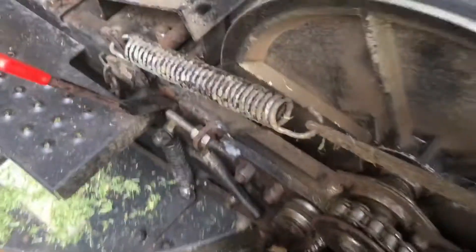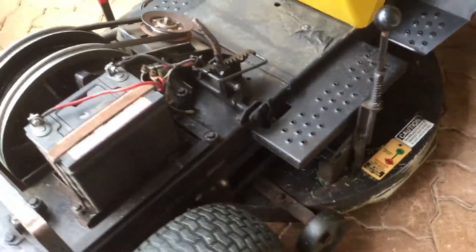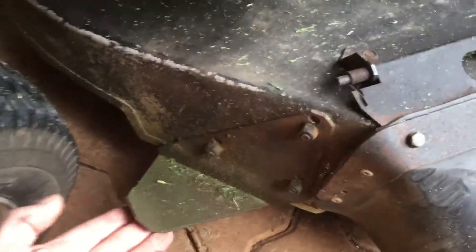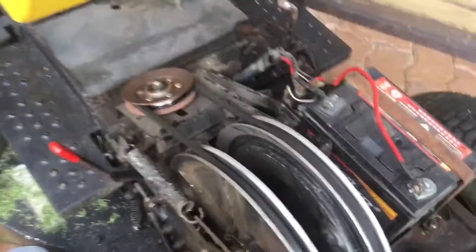Another little thing here — your deck. Now, a little short-ass deck leader, right. You go, geez, that's a short deck leader — that's a cast aluminium deck, and you can also get a fabricated steel deck. There are people that make these too. But if you look at these, they're quite well designed — they're opened up at the nose, opened up around the front. Skid plates on there — this is the base model. There's adjustment on these skid plates, so you can adjust that, drop it down a bit lower if you want the skid plate hitting before that. I'm pretty cautious with mine. Anti-scalp wheel on that side and that side. I'm actually going to put wider anti-scalp wheels on it, like I put on the little one.